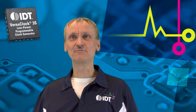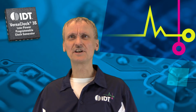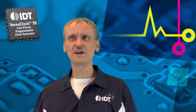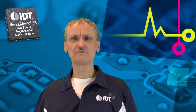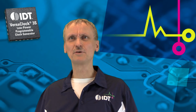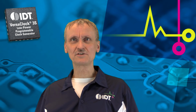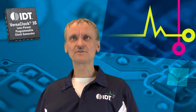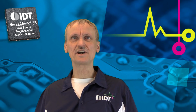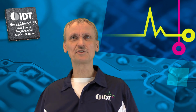IDT's VersaClock 3S family is the industry's most versatile multi-PLL clock generator and crystal consolidation solution for applications such as consumer, industrial, communications, medical, and automotive. VersaClock 3S is available in a small 3x3mm or 4x4mm QFN package. A VersaClock 3S version with integrated crystal is also available. VersaClock 3S is ideal for cost-sensitive and dense applications, and when there is a desire to reduce part count and/or PCB space. You can go to IDT.com for further information.